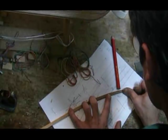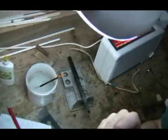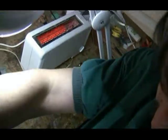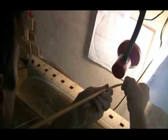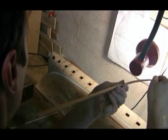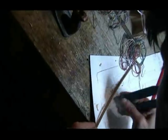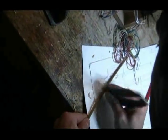This can now be pulled up there. It's very important. Yes, I'm translating this to them into Russian. So that this edge is also smooth. Then this edge. It's not good, yes? Must be very smooth to the next plank. Yeah, okay, that makes sense. The camera get that? He's saying the inside edge needs to be very fluent and smooth for the next plank.